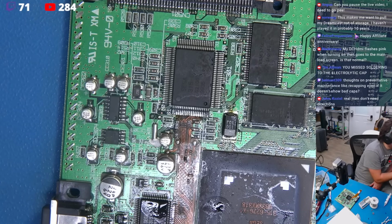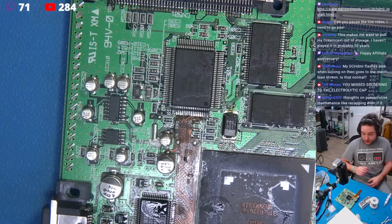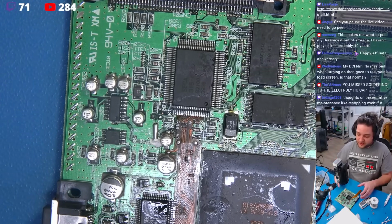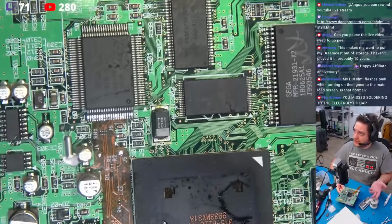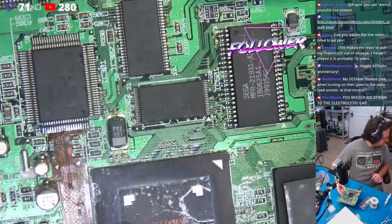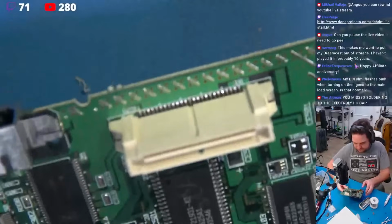Okay. Locate R601 and solder the two long wires. Okay, so no, GDMU, I don't care about DC Digital controlling that. I'll do the button presses myself because, quite frankly, I don't trust the DC Digital to do that properly. I read in the forums that some games, like when you play D2, for example, it doesn't work properly because you have to be very specific with the button presses. So, having said that, locate R601 and R602 and solder two wires.